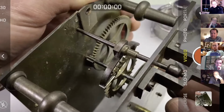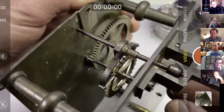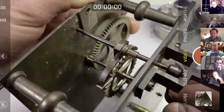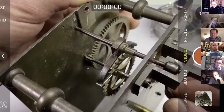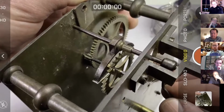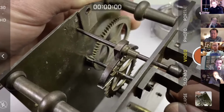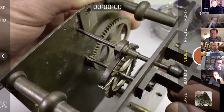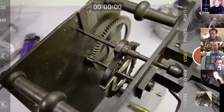So the drops look really good, but there it's jamming. There's not enough internal drop, sorry. Frame's really wobbly. There's not enough internal drop, which is perfect. So that tells us that the length of that entry pallet addition that we put on there is about perfect, because once it's hardened and fixed back on again, we can just stone it back and that'll release that tooth.